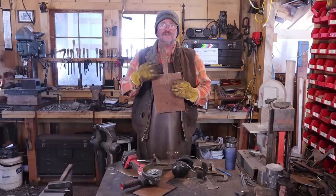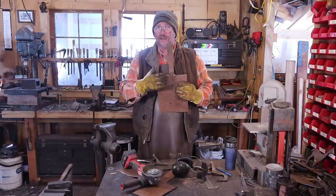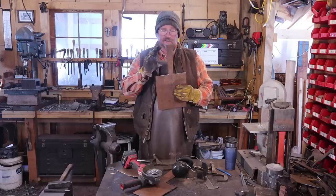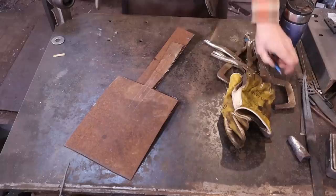This is the main body of the shovel, but it's only half of the socket. This is actually a two-piece socket — it has a riveted-on piece that goes on the front of the shovel, and that makes the entire socket, the neck of the shovel, and the attachment of the handle much stronger than just a piece of sheet metal. I'm using 14-gauge mild steel. It's not going to put up with tons of abuse because it won't be hardened and tempered, but I suspect a lot of the original shovels weren't all that hard either.